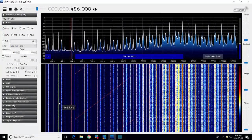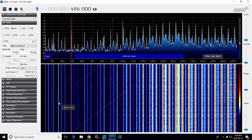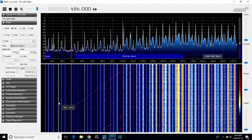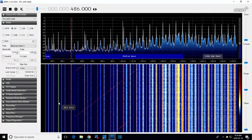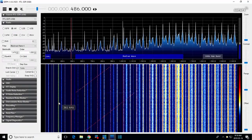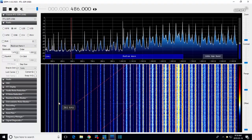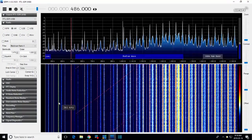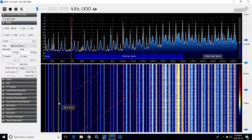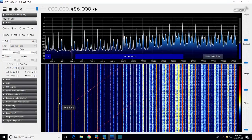So why, notice the signal I'm putting in is pretty close to the noise level, eh? On that, why is there so much noise there? And my long green clip lead is not helping the situation here. So I'm going to try to get around the clip lead problem here. Think hard here before you make a mistake.